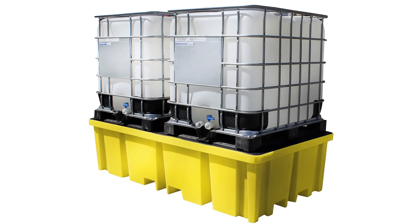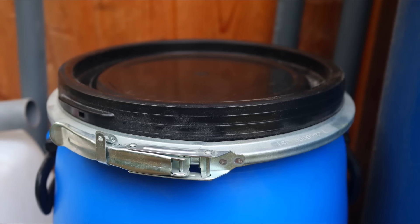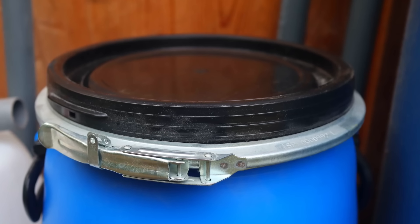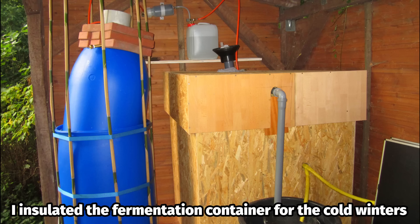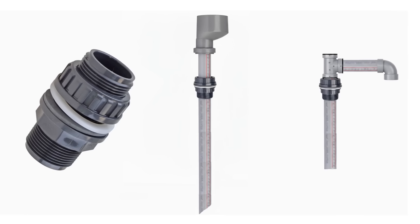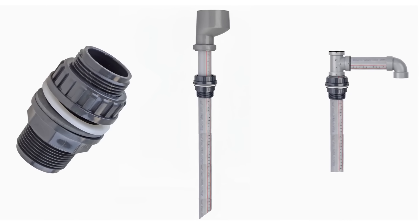Any size is possible, from single containers to several IBCs or water tanks. Wide neck barrels with clamp rings and rubber seals are very practical and can often be purchased cheaply second hand from fruit producers. As a general rule, in an effective system, the container's filling volume can be used as an estimate of the daily gas production. Robust and practical for the inlet and outlet are PVC waste pipes, which I have generously glued with tank bushings.